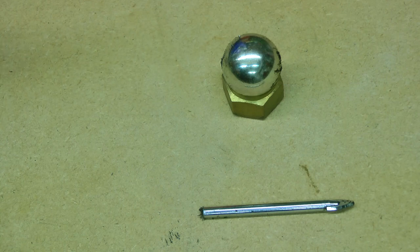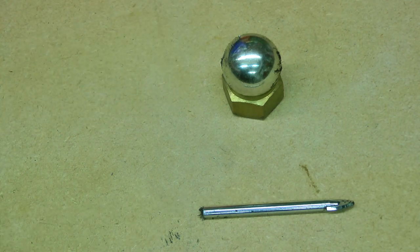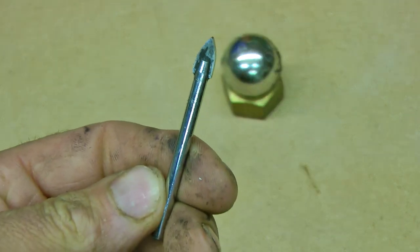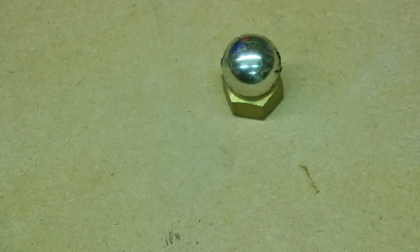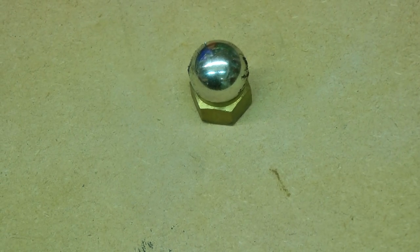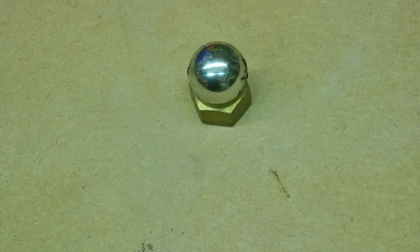On an upcoming project I need to drill a hole in one. Not with one of these — this is too big. We're going to try a tile bit, a carbide bit, because we know these things are very hard and have an outer shell of nickel to protect them from the elements. So we need to drill this nice and slowly, not create too much heat. I do believe if you go over 80 degrees it affects the alignment and it loses some magnetism, so we'll have to go very carefully.